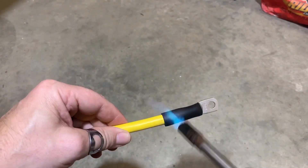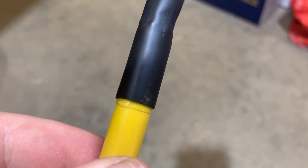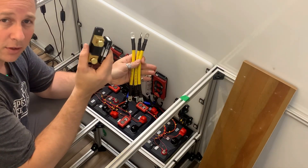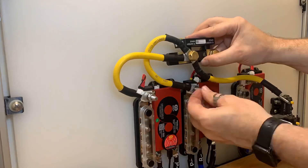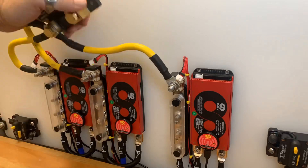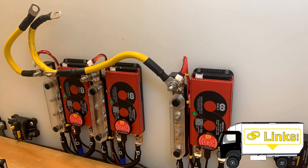Lastly we want to finish things off by applying some good quality heat shrink. When you're doing a project like this make sure you buy the heat shrink that has a sealant in it — this will prevent moisture and oxygen from getting to the connections and corroding inside your terminals. You know it's sealed when you see it coming out. Now that I have three identical cables I can loosely attach them to the shunt and then we can start placing the shunt based on the wiring. To get the final placement of the shunt I'll connect all the wires loosely. This three-armed octopus may not be as pretty as straight lines and nice round corners, but it's functional regardless of the aesthetics.